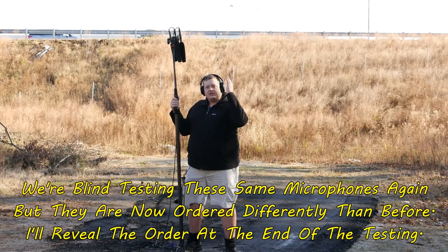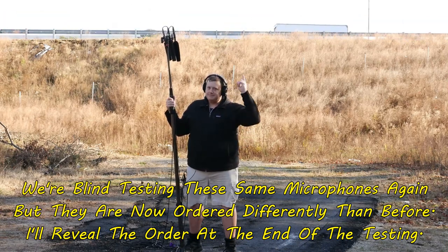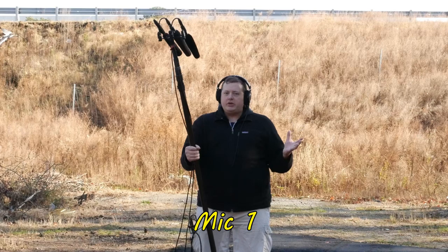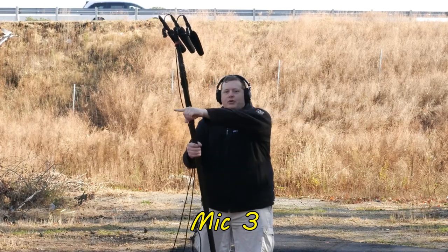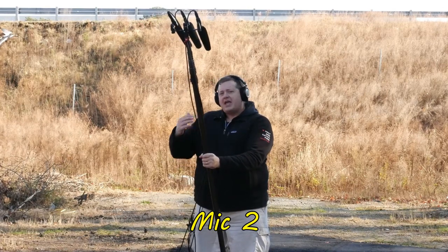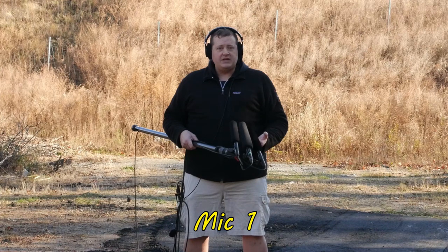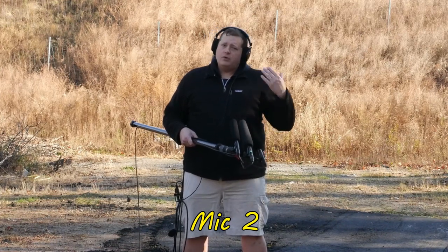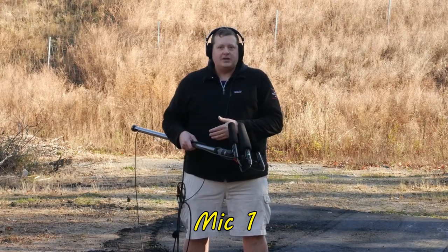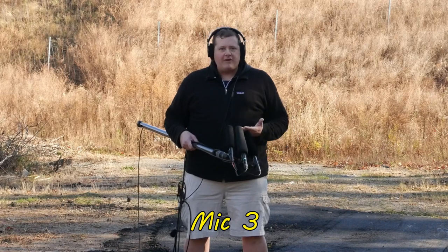For our first real-world test, we're exterior in a very noisy location. Behind me is Interstate 85 and directly behind camera there's another very busy road. The microphones are only about 2.5 or so feet away from my mouth, kind of like they'd be coming up and over the top of a camera doing ENG-type work. Also in ENG style, it's very common to come up from underneath — under-booming — which you might also do to eliminate background noise or avoid casting shadows.